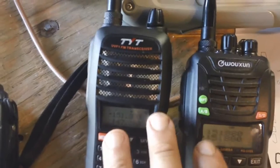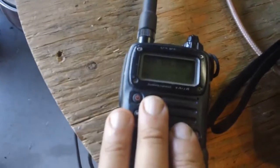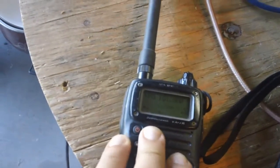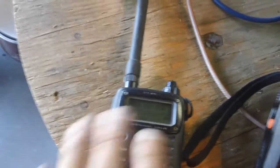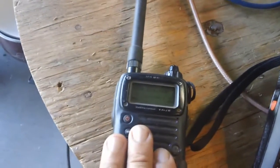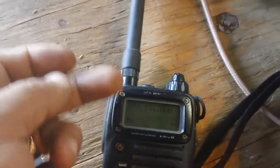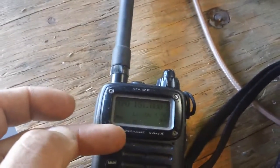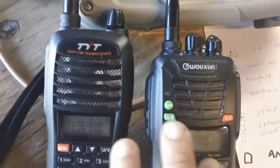These two radios have only one heartbeat, so they can only do one function at a time. This radio here — the Yaesu VX7R — has a dual VCO circuit, so it's actually got two hearts in it. Not two brains — that'd be two separate CPUs — but two heartbeats. So it can simultaneously scan two different frequencies at the same time; you could scan one frequency and transmit on the other simultaneously.